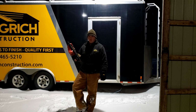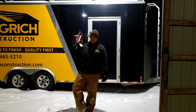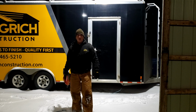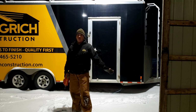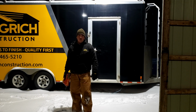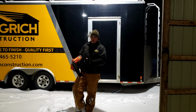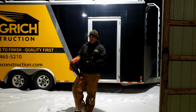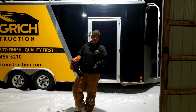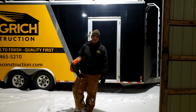On the good side, we really like these nailers for production. They're very fast. They're heavy in comparison to an air nailer, but we're not dragging hoses around. We can go wherever we want with lifts, and we don't have to worry about compressors. Especially in the wintertime here, we find air compressors not the most reliable. And so far it seems that these work okay in the cold weather. They do generate a fair bit of heat, so they stay warm. In the summertime, we have had them overheat some, but only on the hottest of days, which up here in Ontario, we don't see the heat you would in the southern states, of course.